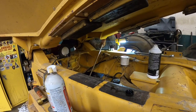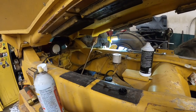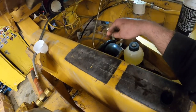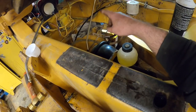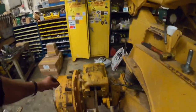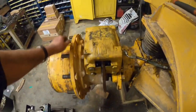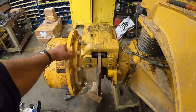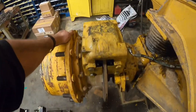I thought this day would never come, but I think we actually got brakes. It is here. Can you believe it? Matt's actually just putting air in the backside of that chamber with shop air, so we don't have to start and run the truck. We got everything bled out. It's amazing how much better it bleeds when you don't have four random holes in a caliper. It's crazy. As you guys can see here, it turns, as soon as he puts air on it, stops, and there it goes again. Other side is the same way.